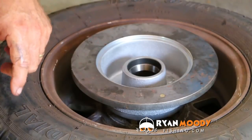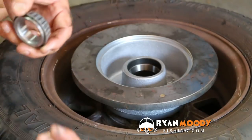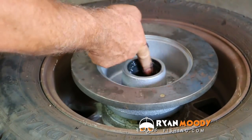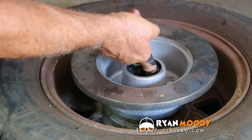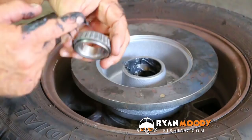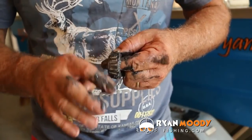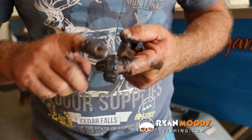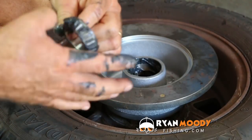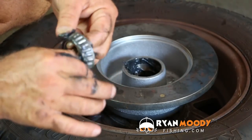Now while I showed you this little tip mostly to show you how to make these little gadgets, also another thing too where people go wrong is with the amount of grease. Just smear a fair bit of grease in behind it there. Use the appropriate bearing grease for marine use. Just smear a fair bit of grease in there and push it to the back. But what you also got to do is in the roller itself, in the bearing, all those roller pins, smear the grease down in amongst them and work them into the bearing. It's very important that you do that. Don't just plonk a dry bearing in there because it's going to take a little while for the grease to run right through it once you put it all back together, and that's where you can do a little bit of damage early on. So massage the grease right through all the rollers.